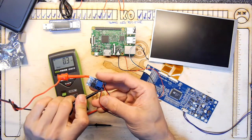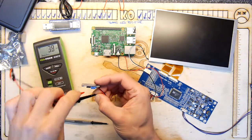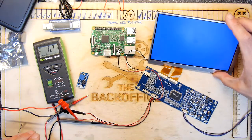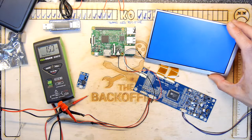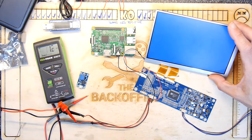Right, let's just hook up the screen directly to the power supply and see how many milliamps it uses. Currently the power supply is set to 5 volts, so the screen probably won't come on or won't be happy — it will just come on and be dim. There we go. To be honest, it doesn't look particularly dim compared to that 12-volt feed. I'm just turning up the voltage now — we're at 11 volts, 12 volts. At 12 volts it's using 300 milliamps, and back down to 5 volts it's using 533 milliamps.